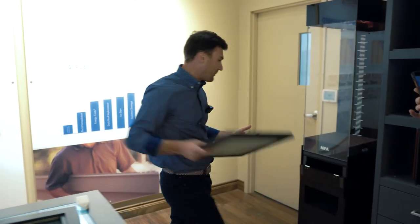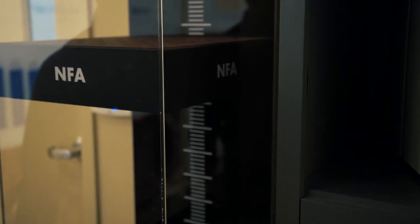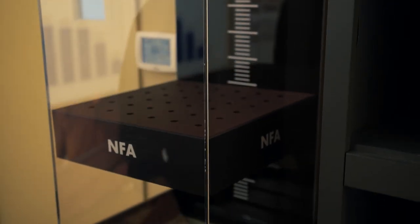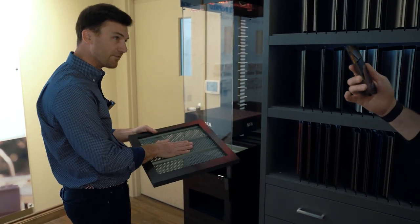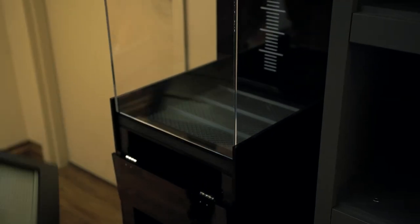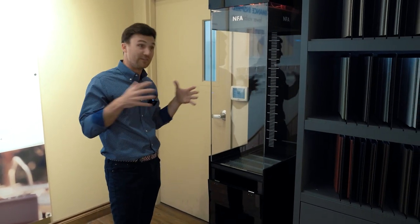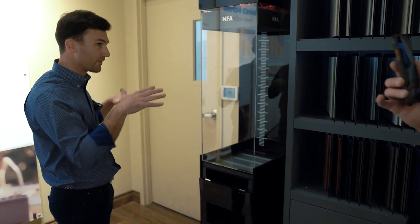I'll show you what happens — just so you know I'm not cheating. We'll let all the air in. This is what it should look like: you should have your NFA high. You don't want low NFA because when you have low NFA, your attic is going to suffocate, weather patterns are going to create, your insulation value is going to go down, and it's going to cause mold and mildew issues. Our soffits are well ventilated. You can see that ours does slow down a little but it still gets great airflow, and you don't want a hot attic in the winter or summer.